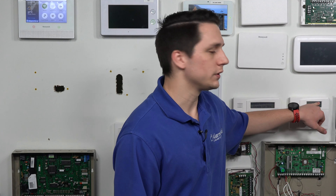If you're not looking for that deeper level programming and just want a very normal basic keypad, then the Honeywell 6150 is another option. As you can see here, the 6160 has a larger display — it shows in full words 'disarmed, ready to arm' — while the 6150 has a smaller display and just shows abbreviations like 'AC.' The 6150 is a fixed English keypad, meaning during programming it won't show full words as the 6160 would; it shows numbers for the different fields. It's a nice keypad for basic arming, disarming, and bypassing zones, but it's not truly the best for programming.